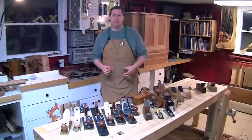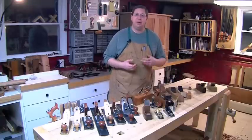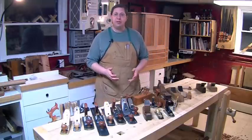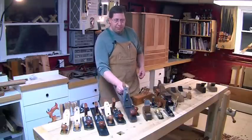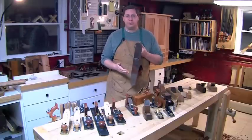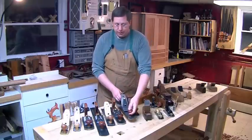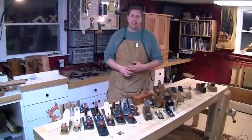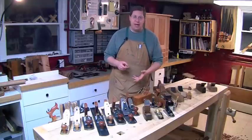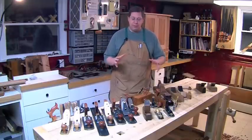Because of that misconception, people are buying one of every plane — a five, a six, an eight, and a bunch of other joiner planes — and they may not even know what they're for. The handplane is essentially nothing more than a chisel held at a fixed angle. The sole along the bottom provides a reference surface so the chisel can reference off that flat surface and make your workpiece flat as well. Different ways to shape irons, different lengths, how tight the mouth is, the angle of the blade and the bevel — all play different factors in determining what that particular plane excels at.